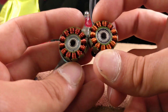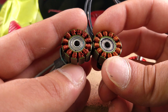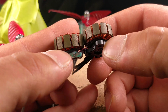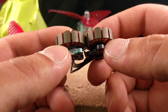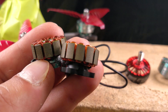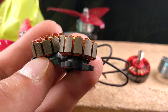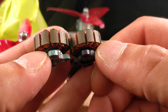The motor on the right is the Xing motor — that's a 2207. What's special about this Xing motor is that it has 0.1 millimeter laminations, which is really special in this industry because getting these laminations really thin is very difficult and it costs a lot as well.